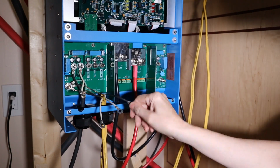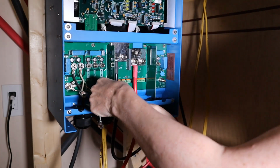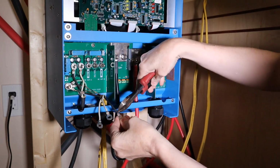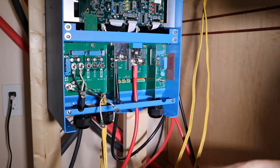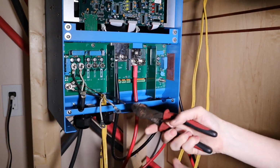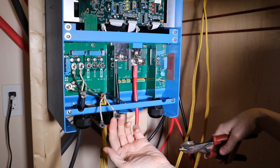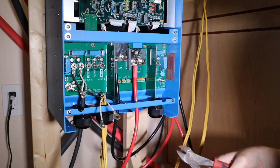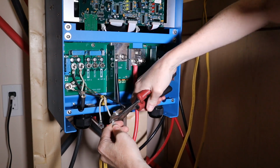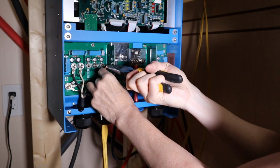I was having a thunk as well about these ring terminals. I don't like, yeah, see, I just twisted this a few times and now it's spinning on the wire. These are crap. I can't use them. So I am going to cut them all off and just strip the wire bare and do it like I'm doing an outlet, like a plug, where you just fold the wire over and screw the screw down on it. Ring terminals would have looked nicer, and I spent a lot of time figuring out how to shave these off. It's much better to walk away from work you did than to persist with work you did when it's not smart to do so.